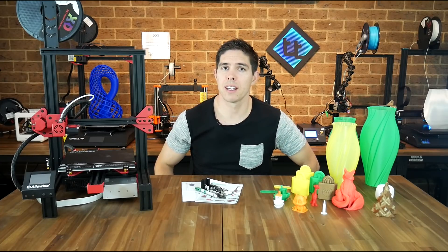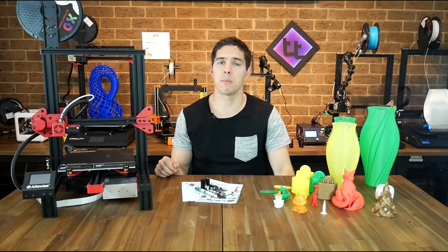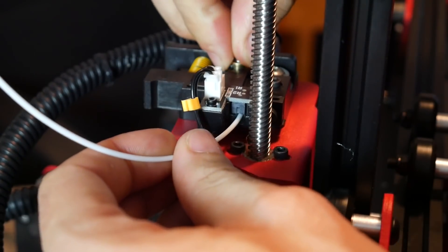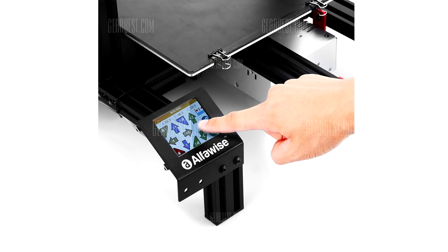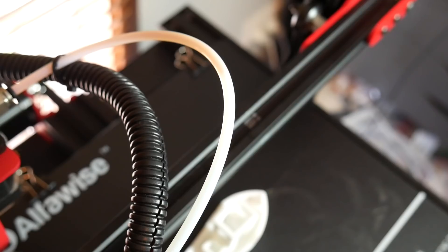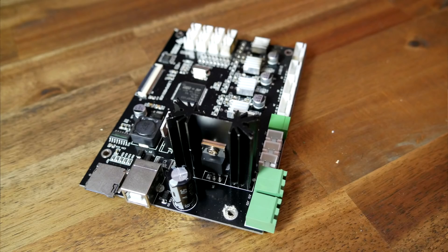On to my summary. Let's start with the pros. The first thing that's good about it is the price — considering all the problems I've had, it would be an absolute nightmare if this were more expensive than equivalent machines. The filament run-out sensor is welcome and implemented in a fairly neat way, naturally in the path of the filament on the way to the extruder. But probably my main highlight for this printer is the color LCD screen — I much prefer the layout and the commands available compared to something like an MKS TFT, including the option to have continuous load and unload, which helps a lot with filament changes. The 32-bit board should have been an asset, and it seems like pretty nice quality with a really big heatsink for the MOSFET — but ultimately the results don't prove it's worthwhile.